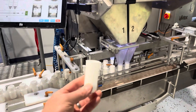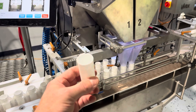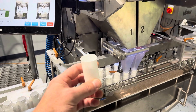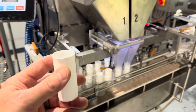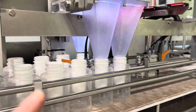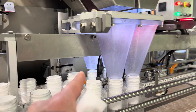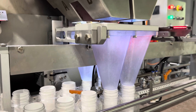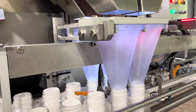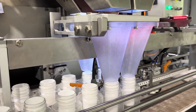For the application for filling these tubes, we've developed two new features. The first one is as they go into the bottle — because the opening is so small and we're filling at a decent rate, we have to prevent them from getting jammed in the funnel — so this bottle control allows for the products to pull through without getting any jams.